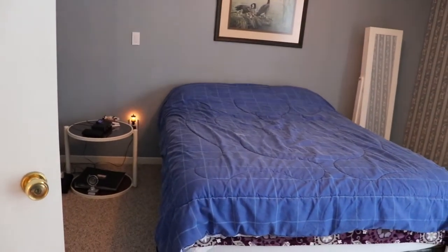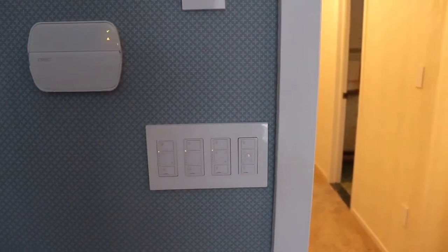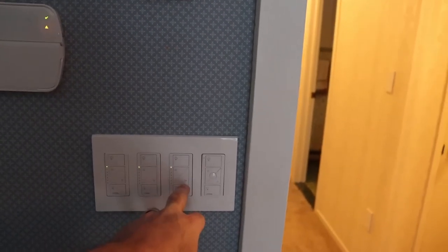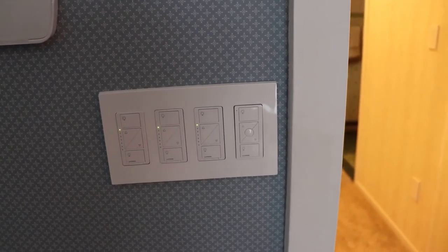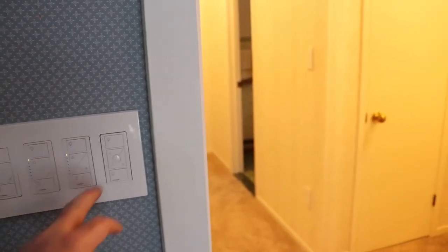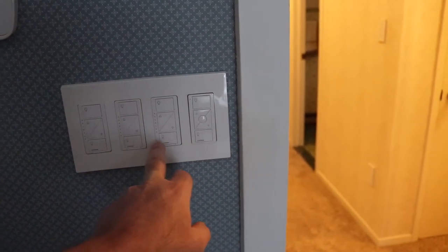And then they also had the top of these wall receptacles set up on a light switch as well. And it's a three-way switch. There's a switch up there and here. So you have to like snip the conductor on the side of the receptacle. You could stick it in there. But I found that this wouldn't program until I put the night lights into the socket. Otherwise it just was not happy at all. And then this one just turns all three of them off together, like I was trying to demonstrate downstairs.